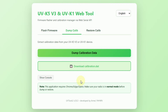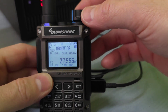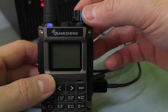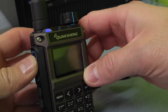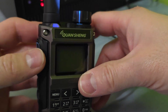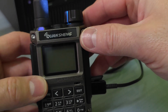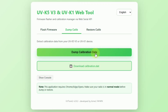The radio is connected, so click connect and wait until the radio backs up. Now you can download the calibration data — click download. Next, we need to turn the radio into flash mode. You will enter flash mode if you turn off the radio, push and hold the PTT button only, and turn on your radio back again. You can hear the sound that the radio is connected and the flash mode is turned on.